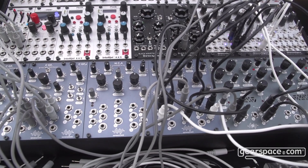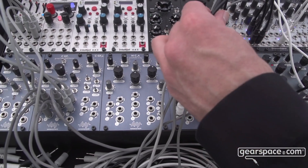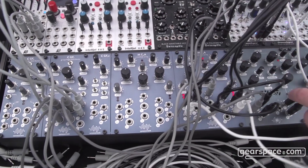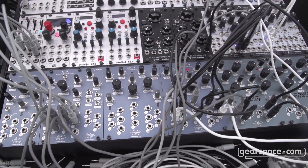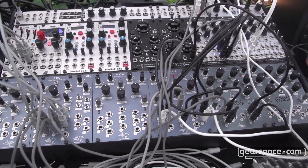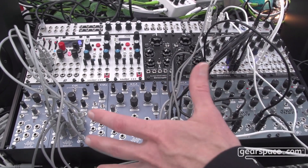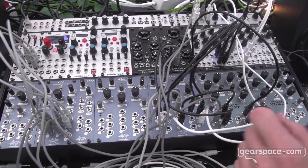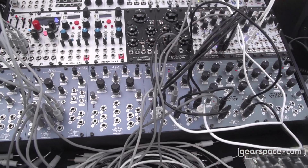In this case, one stage is coming straight from the crossfader, it then goes to the Polyvox filter, and then back to the second stage of distortion. So much heavier distortion pre-filter and then a more gentle distortion post-filter, going straight to the output. Together all the modules allow fairly complex modulation to be set up quickly and still give easy manual control points throughout.